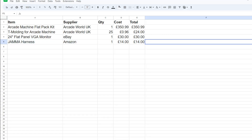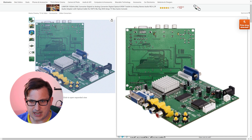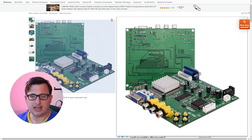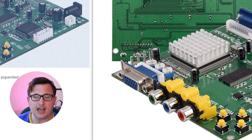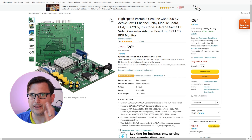Let's add that to the list — round it up to £14 for Amazon price fluctuations. Next up we need to think about our video signal. A normal arcade video signal would go straight into a cathode ray tube TV and sync up and work, but because we're going to a VGA monitor we need a board to convert that arcade signal into a VGA signal the monitor can display. This converter board has a connector that takes the input from our JAMMA harness — red, green, blue, sync — and converts it into a VGA output. It's also got control buttons for adjustments and menus, and that is an absolute steal at £26.